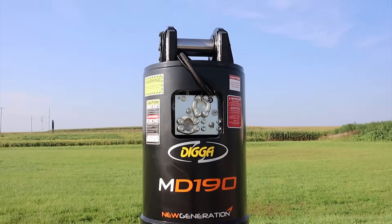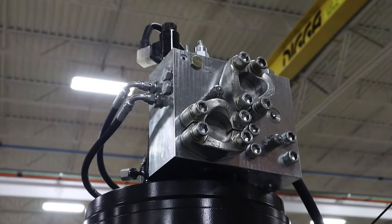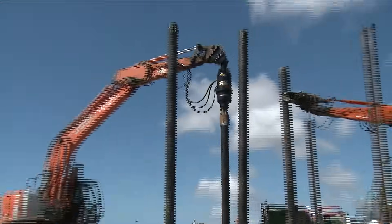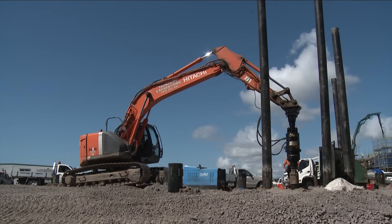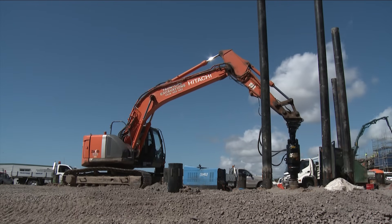These units are supplied complete with built-in pressure relief at 3,500 psi and a built-in energy control relief valve, which protects your gearbox and hydraulic motor from the effects of pile kickback recoil, which is common in a helical pile installation. We also offer this unit in a high-pressure version rated to 5,000 psi, and a high-speed, single-speed version.